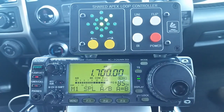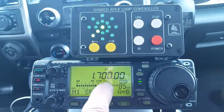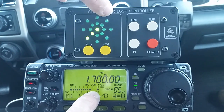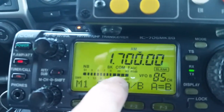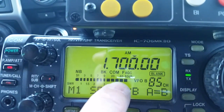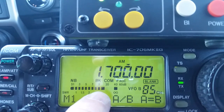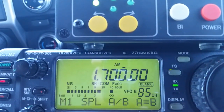We're looking now at a station to our northeast at 1700 kHz. You can see by the S-meter, as it automatically flips from northeast to southwest, that we have approximately S40 to S50, sometimes S60, down to S9 plus 10 dB. So we're seeing approximately 40 dB of front-to-back ratio.